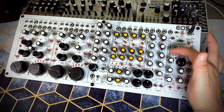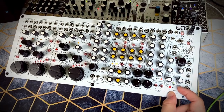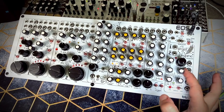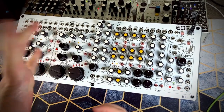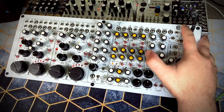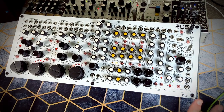The toggle switch with the light — when the light is green and the toggle is to the right, the delay is on. This turns it on and off, or we can go to momentary mode where it's always off and only on when we hold the effects button. The light does not correlate to the momentary mode. We have our delay time, repeat amounts, CV amount for the time input, and spread amount which adjusts the time in opposite directions for left and right. We also have free-flowing LFOs or trigger sync on for the LFOs to work with the trigger sync. That is the super quick walkthrough of the Ergot Organic Synthesizer.